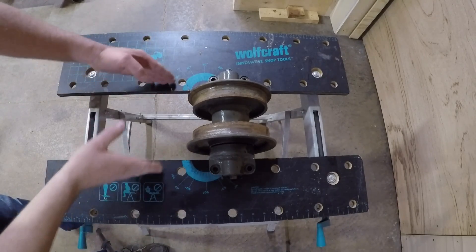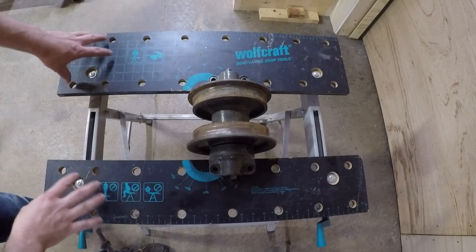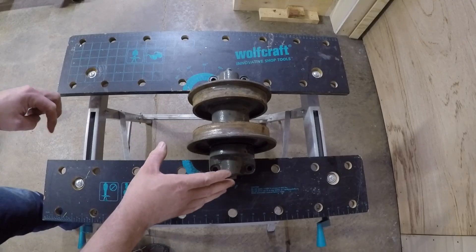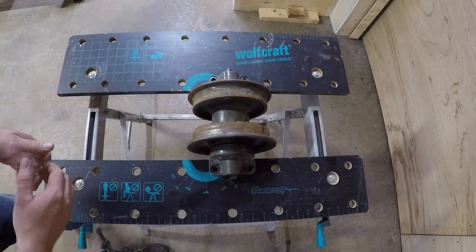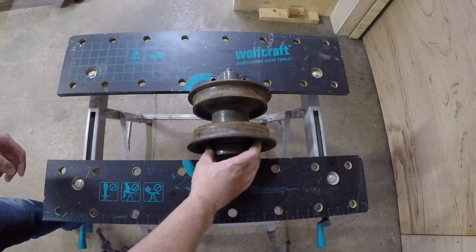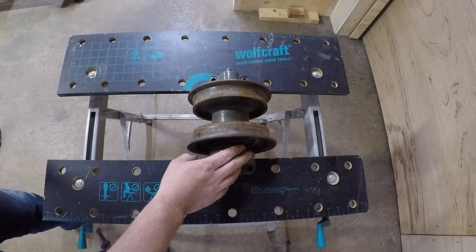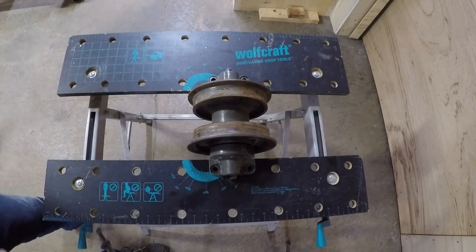I took an old portable shop table and set the tabletop halves with a seven-inch wide gap between them, replicating the Cat 10 track frame width. I clamped them down so I could put one roller at a time in there and check the end clearance. If something was a little tight or loose I could go back to the press, make a small adjustment, and verify. My goal was to get these as close as I could to a 32nd of an inch side clearance, because these old-style rollers don't have any grease seals, and more clearance means more grease leakage.